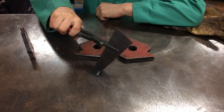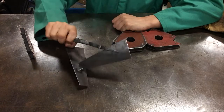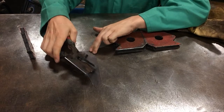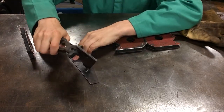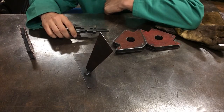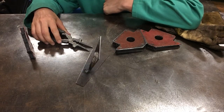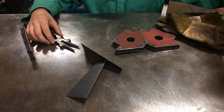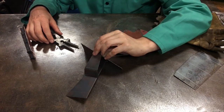And if you want to know how strong it is, you can try to break it, generally with destructive testing, to see how much effort it takes to break your weld. And you'll notice that the sheet metal is bending, but the weld is still good. That's what you want when you do a good setup and a light tack weld, okay? So now what we're going to do is start sticking things to other things and show you what a good seam weld looks like.